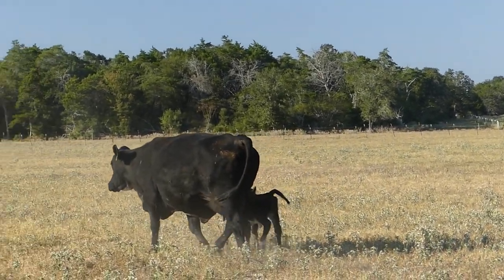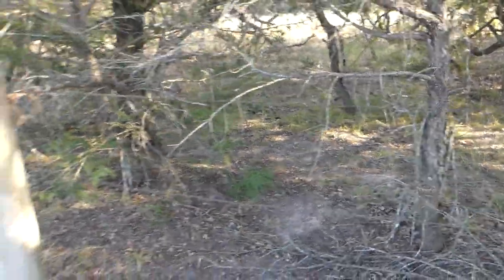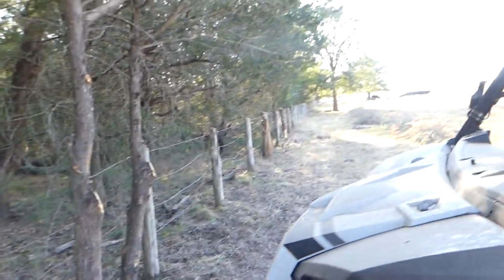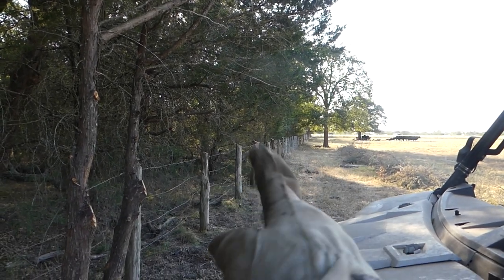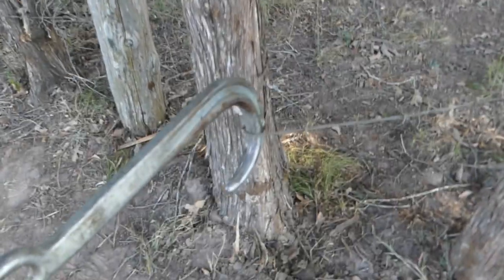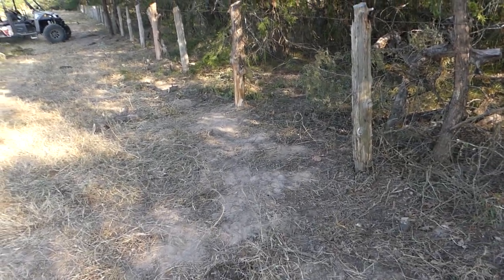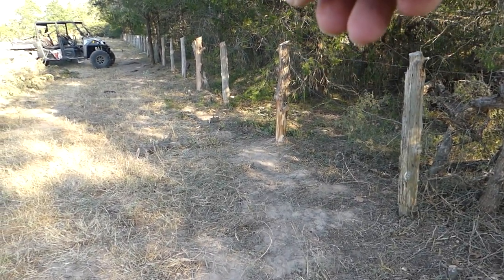Didn't mean to shoo you off, but you are along the fence and I'm working. How cute. Let me pull back on that bottom strand that has two splices in it. See the top strand? Not looking too bad. It's not guitar-string tight, but it's tight enough. When all's been said and done, I'll go across each strand and give it a little crimp if I need to pull any slack out. Let me do that bottom strand. I've got it pulled a little tight. It's up where it needs to be. There's the first splice. There's the second splice. Still not too bad. I might be able to pull that all the way out — I'm going to use my hammer and see if I can scooch that excess out. I've got all the wires stretched, clear down to that tree way down there.